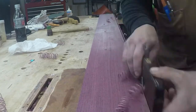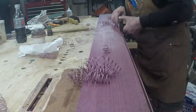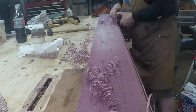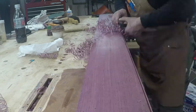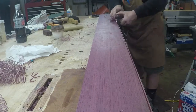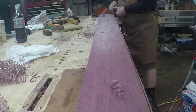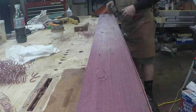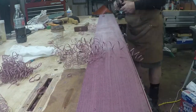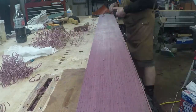With this frame, I hand plane after everything, scrape it, and then I do a final sanding to get rid of any kind of imperfections. And also, these edges are extremely sharp and they hold their edge because the timber is just so hard and dense. I actually cut my thumb really bad getting it pinched on one of the corners, so I alleviate the corners for the client for splinter reasons and safety reasons.